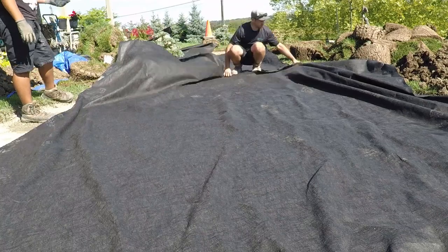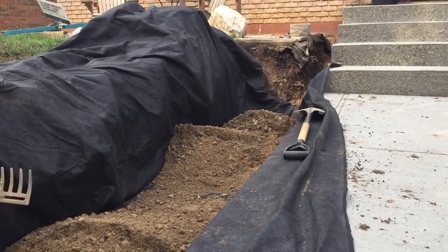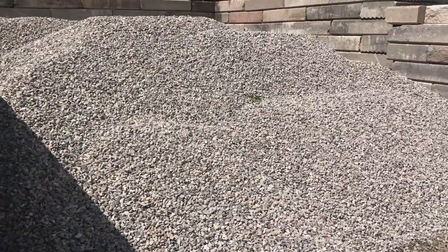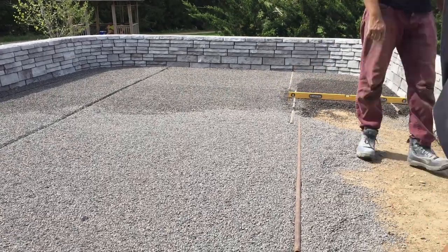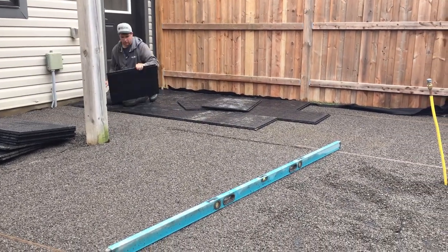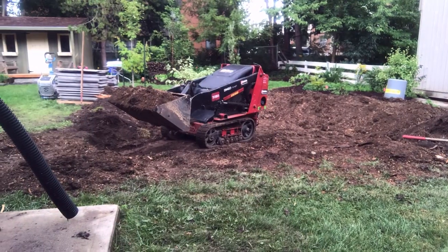This means you should have already picked out your paver base. If you haven't, we have a video on the best paver base materials — whether you're going a traditional base, which is a dense graded base incorporating a three-quarter inch down-to-minus plus a concrete sand bedding layer, or if you're going open graded base with an HPB or quarter inch chip bedding layer, or alternatively a synthetic base which is a condensed polypropylene sheet. You can check the link in the description below — there's no one best solution, it depends on the application.